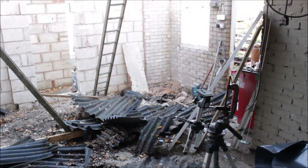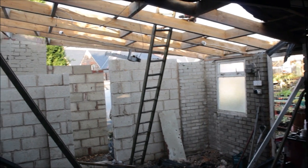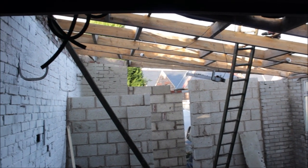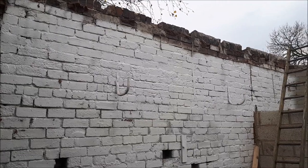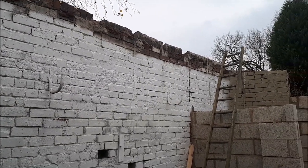I still had to remove all the joists because they were sat flush with the top of the wall, and the original bitumen sheets used to sit over the top of the wall, which left a gap. And if you look at the top of the wall, you can see where the grooves have been where the joists sat in.